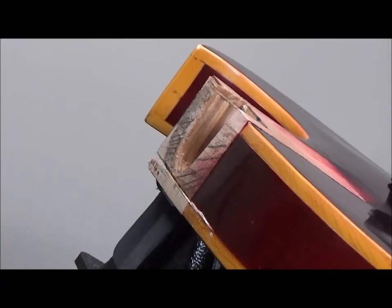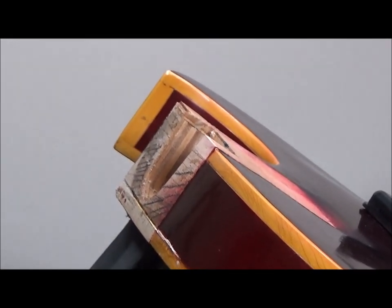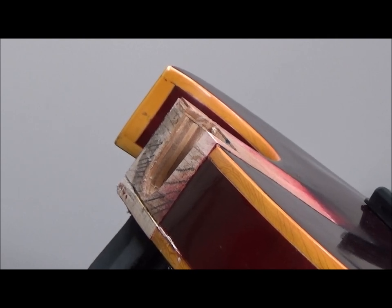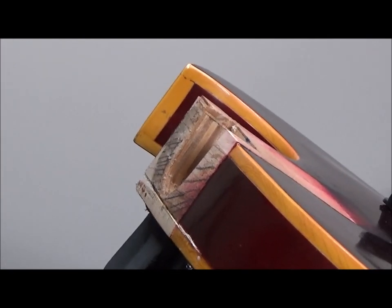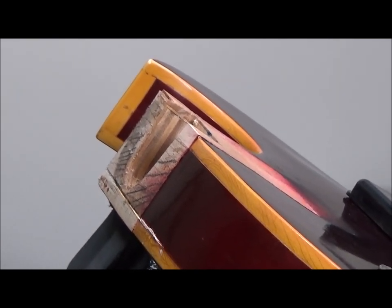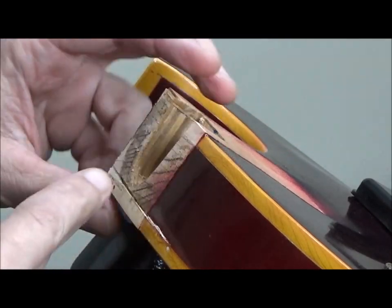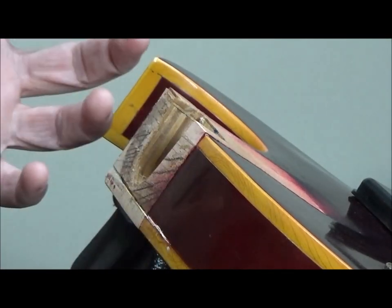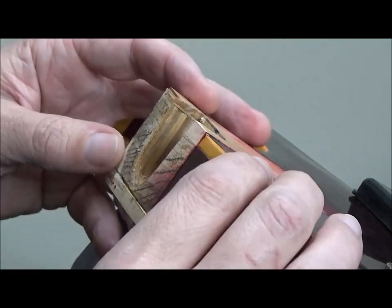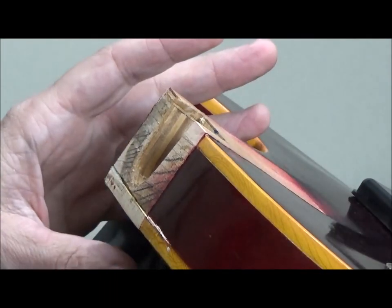But I was on a Zoom call with some other repair techs, and someone was working on the same guitar. He had the neck off, and we were comparing things. The thing that he did that I did not do was, as soon as the neck came off, he was prepared, and he clamped everything back into place, because this plywood neck block is definitely going to delam once the heat gets in there. So all that old hide glue is already soft and heated. Clamp it up. What I did wrong is I waited.